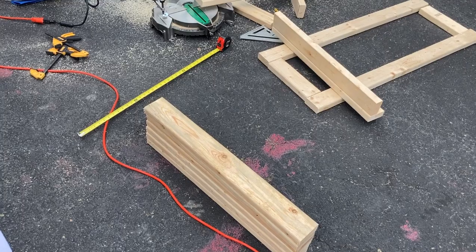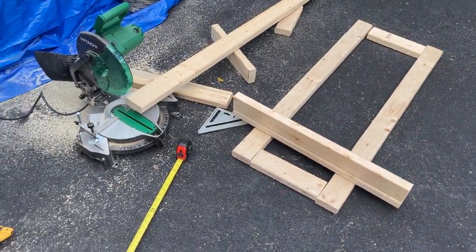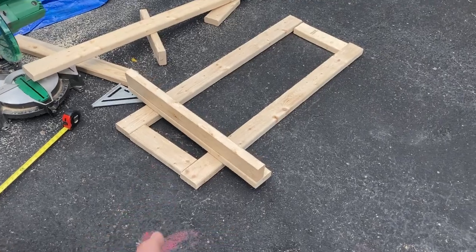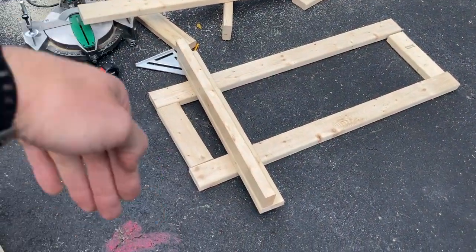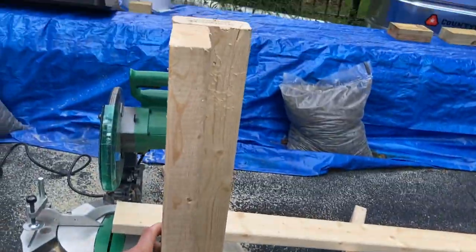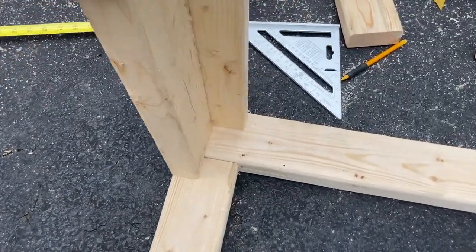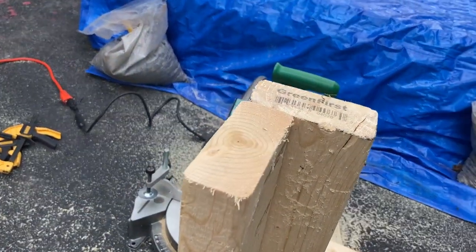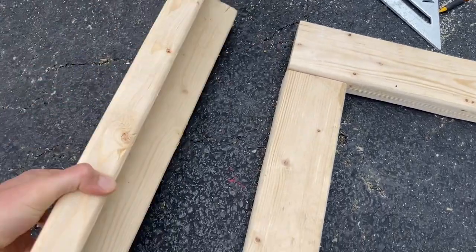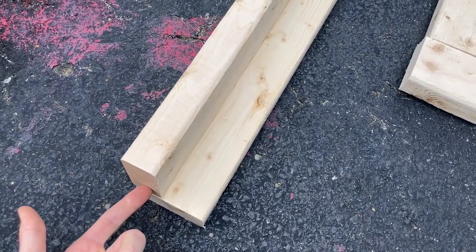Then eight cuts — and you can do this to any height. Another nice thing about making your own custom table is you can make it to whatever height you want. I'm building it to the height of my window sill, so I want a 32-inch total height, going at 30 and a half inches for the legs. The way the support system works: when you're looking at the tank from the front or back you just see a flat piece of wood, but all the weight in the corners — you see how this connects — we make this L-shape, so all the weight pushing down is wood on wood. That's why the screws aren't that critical.